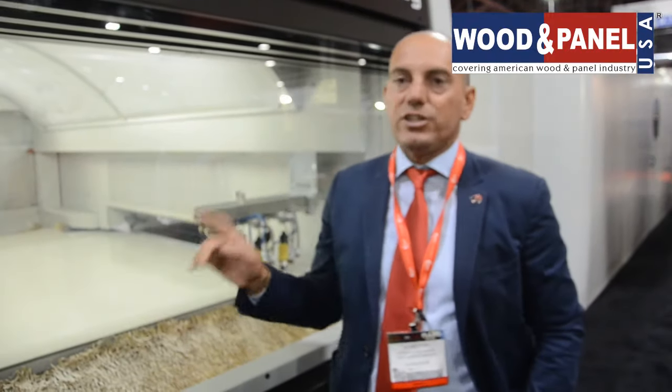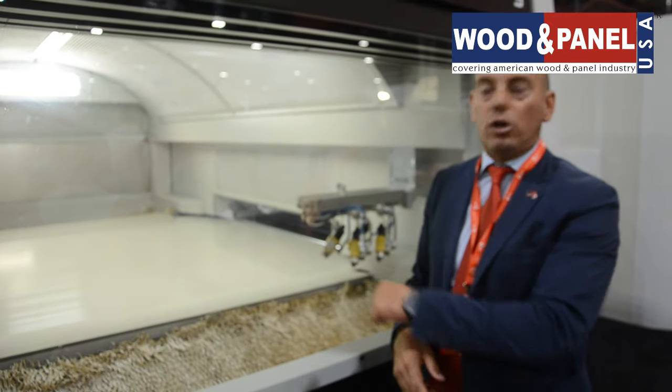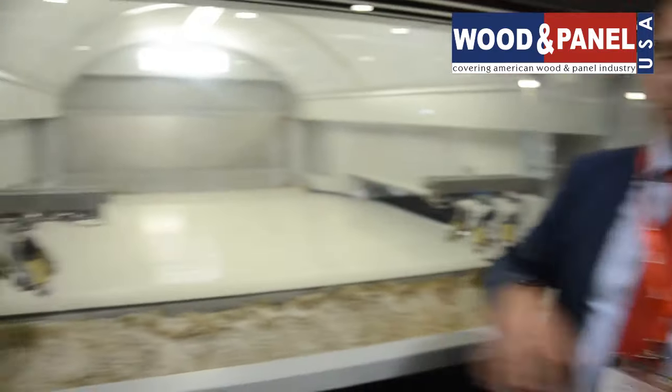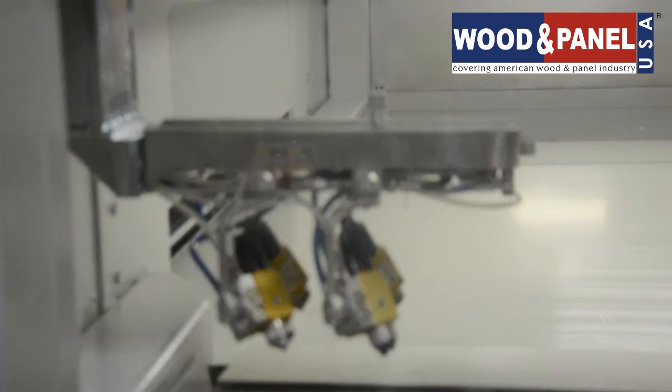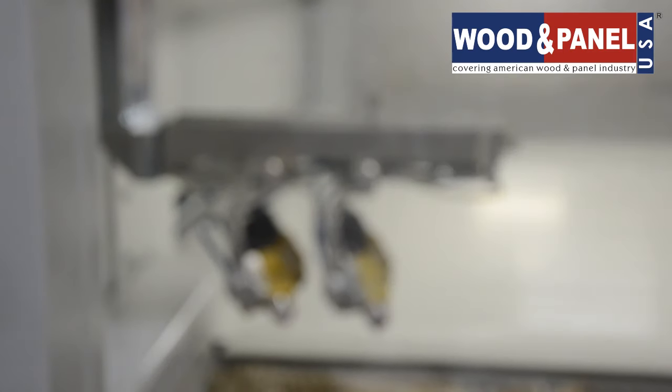This is the Easy — as you can see, different from the other machine I was showing you. It has a CFP belt, always with dry filters. We can also equip this machine with water filtration. The machine efficiency is always guaranteed, but you have to be very careful as an operator on controlling the level of your filters. If they start getting full of dust, they will no longer have the power of attracting all the particles going out of my belt, so we can start to have particles flying around the area, starting to stick on parts of the machine where we don't want them. When the paint dries, a little bit of vibration can pull them down and contaminate my pieces.